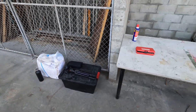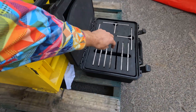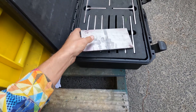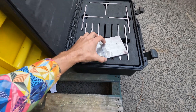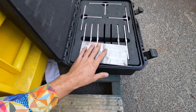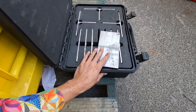I've got face masks, another camera, GoPro, rags. After I've laser cleaned everything I'll spray it with WD-40 and wipe it down. The reason for that is last time after I laser cleaned some of these things I sent them off and had all sweaty hands — literally corrosion caused by my sweaty fingers. They sent these off and unfortunately had corrosion on them, so I had to redo them. This time, straight after laser cleaning, I'll spray them with WD-40 and that problem is gone.